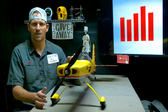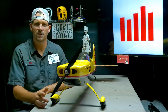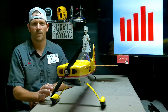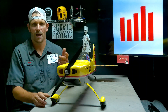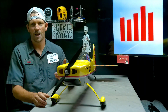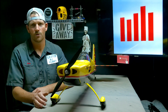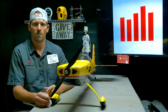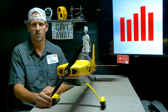Now, if you got an AR637TA in a bind and fly, the menu in forward programming will be very limited — I'll show you that in a second. But if you update your AR637TA to the latest firmware, it will completely jailbreak the receiver where you can use it in any other airplane, just like I have in this one. I have another TA inside my Pits and another TA inside the Edge strip, and they were all originally from bind-and-fly aircraft. You can't buy a TA receiver unless you're buying a replacement for a certain plane. So I want to show you both forward programming menus — we'll call it jailbroke and non-jailbroke — just to show you the difference, and then you can use it for other airplanes.